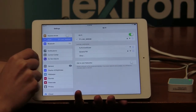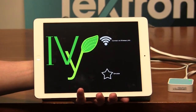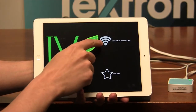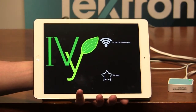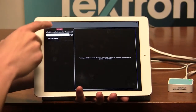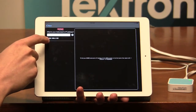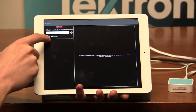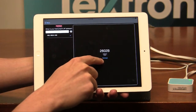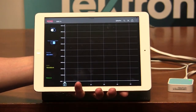We then want to open up our IV app. Go back to the home display, click on IV, and that will open up the IV app. Now there will be two options: the first is connect via wireless LAN, and the second is simulate. We will want to select connect via wireless LAN. Here is where all of our IP addresses will show up for connected instruments. Here's the one we set up earlier, which is 192.168.0.100. When we select that, it will ask us if we want to connect, so we click connect, and we'll open up the main display of the IV app.